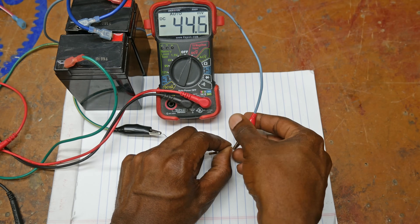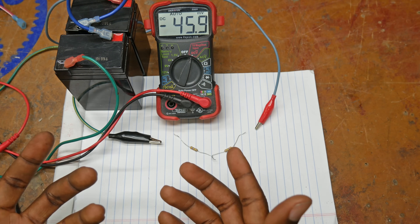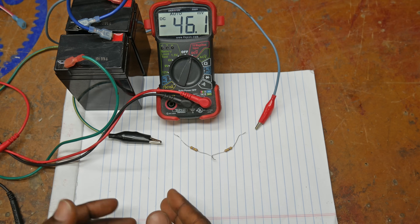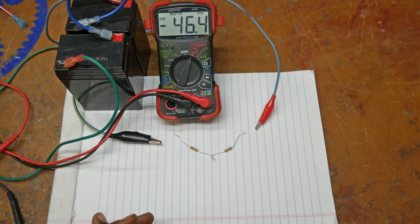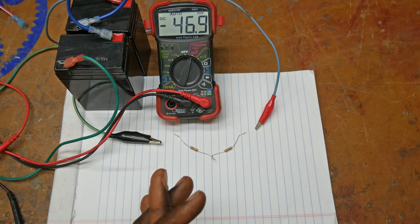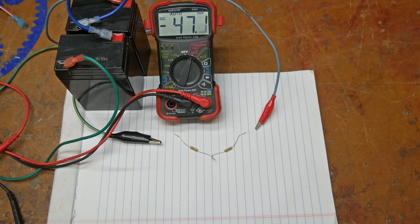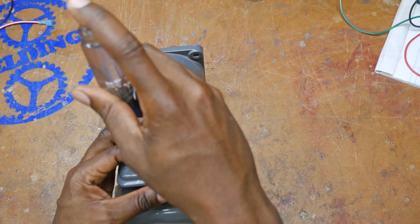This is a really simple and clever way to allow a motor to be flexible — it can be wired for high voltage or low voltage, and the same thing applies with motors that go from 240 to 480 and so on. Going to higher voltages has benefits: you can run a much smaller gauge wire at higher voltage because of less current. If you cut the current in half, you can now use a smaller wire.